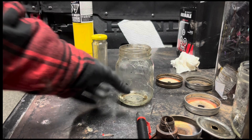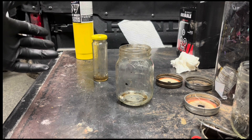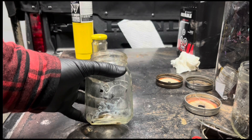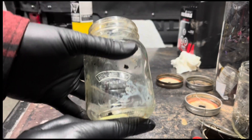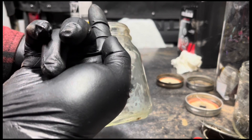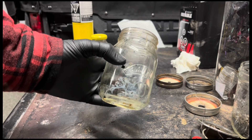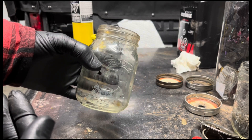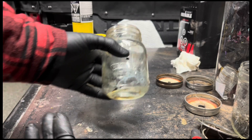Here's another big one. I've often been asked: what are the ideal dimensions for a jam jar jet engine? I've gotten a lot of different wonky sizes to work, but the easiest ones are when the width is roughly half the height. This one falls pretty close to ideal dimensions. It doesn't have to be exact, but if you're close to the height being double the width, it's probably going to be ideal.